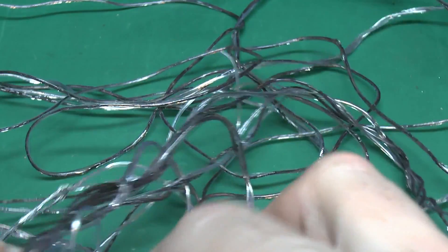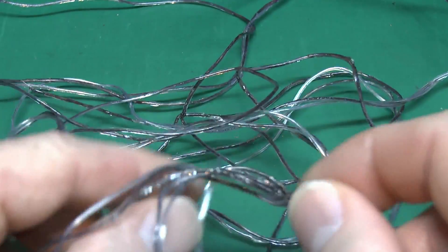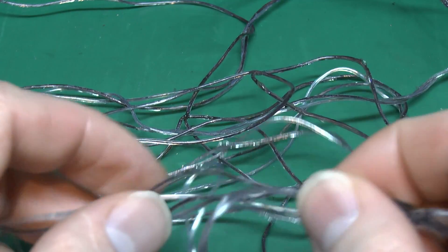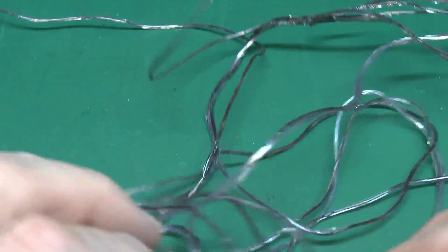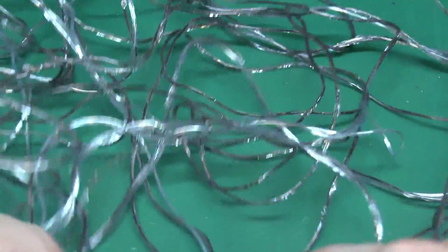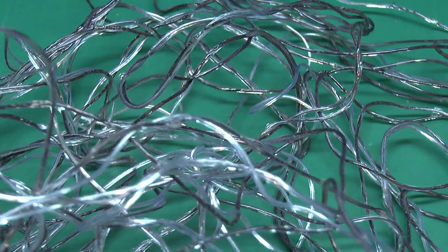Here's a look at the wire afterwards. As you can see it's basically just gone black and the outer casing has gone rather brittle — it's just melting and at some point breaking internally, simply because it's so ridiculously thin. So it appears this wire is so thin and useless that any moderate current simply causes part of it to burn away, and the wire itself acts as a fuse and disconnects its own supply. Fairly disappointing it didn't cause massive carnage, but nevertheless it certainly overheated and gave off a substantial amount of smoke. So until next time, thanks for watching.